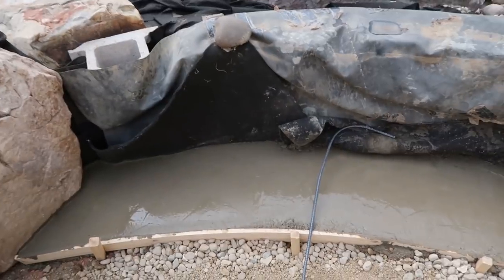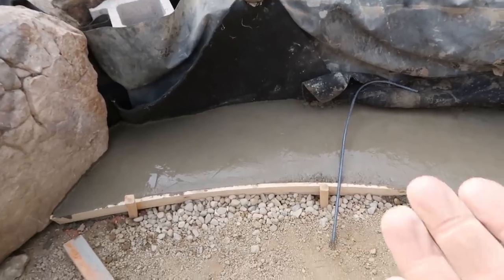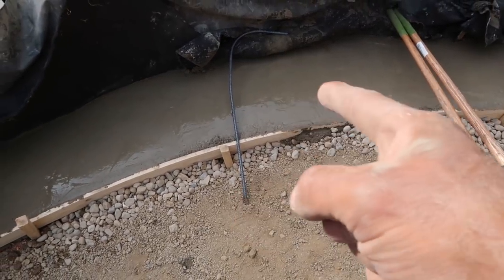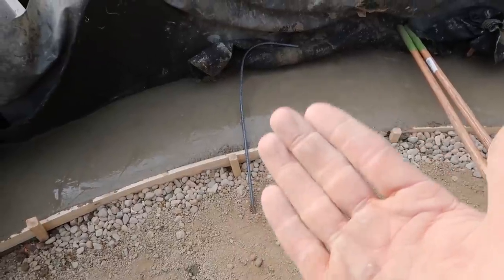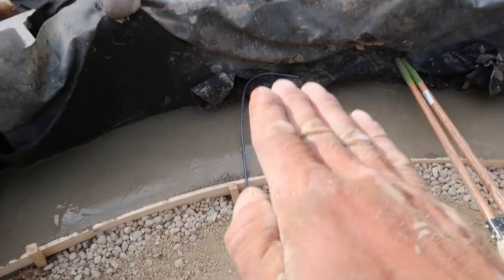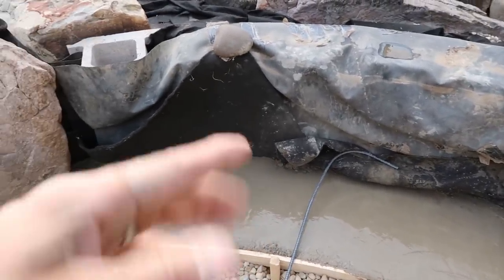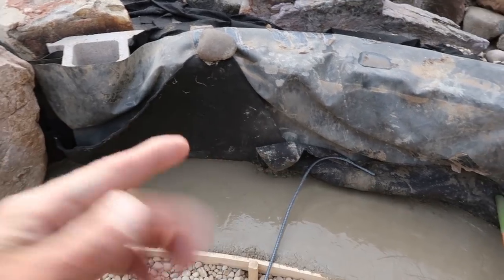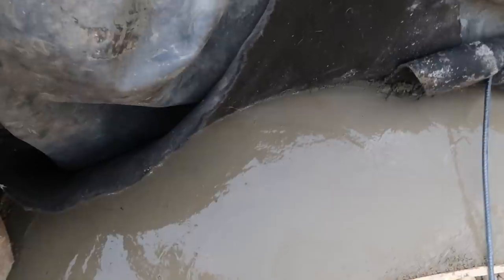We set it just a hair lower than the bottom course of the inside wall, knowing that just in case this isn't totally level, we could throw a little bit of bedding sand or something on top of the footer in order to get those bricks to the level, not only left to right, but front to back as well, so that our courses are nice and even all the way up. And they should end up, the 3 courses on the outside of the liner for this brick wall should be the same height as the interior wall. It's coming together now very, very well.